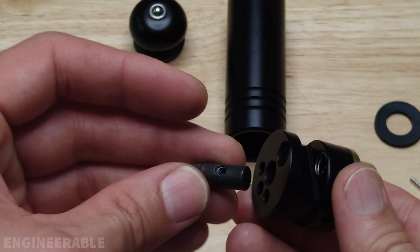There's a spring in here. It looks like they drilled out six holes — those are probably just weight reduction holes. They didn't drill any here because there's a pin that passes through this area. This pin passes through here and pins the shaft in place, so I would have to press this pin out to remove it.